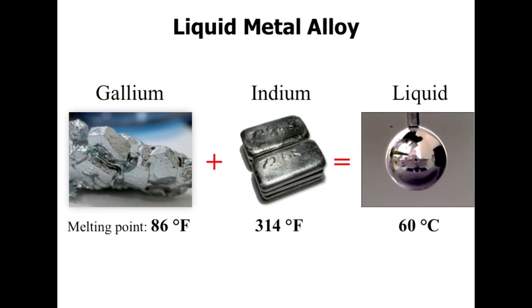But we wanted to ensure it would stay liquid at all times, so we added another metal called indium. This is a little non-intuitive because indium melts at an even higher temperature. When you mix these together, you get what's called a eutectic, which allows them to be a liquid at 60 degrees Fahrenheit. This is the same principle as putting salt on roads on a snowy day — we're using indium to depress the melting point. This material is in many ways very much like mercury, except it's non-toxic and has no vapor pressure, so we don't have to worry about it evaporating. And so we now have our liquid metal.